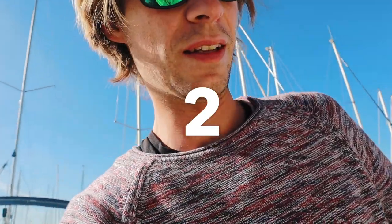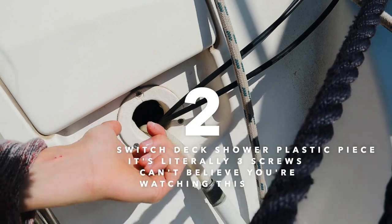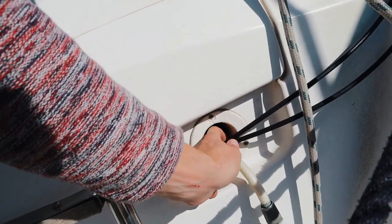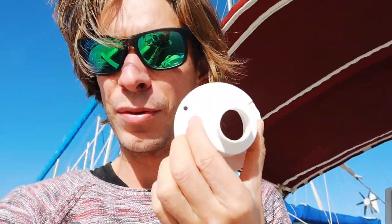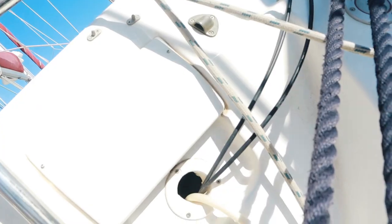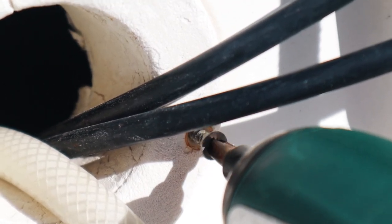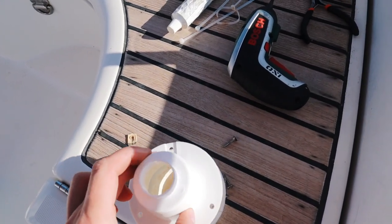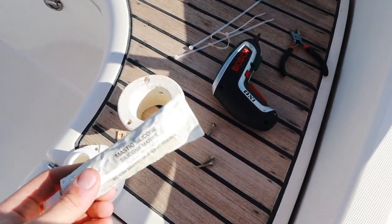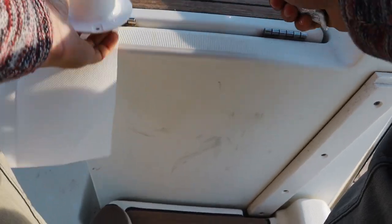We are going to replace a piece that has been bothering me since we got the boat. This is the outlet of the cockpit shower, which hasn't been replaced in probably all 18 years. We broke it off on the inside and there's plastic dangling around everywhere. We actually use it as an inlet for the solar which is on the Bimini — pretty dodgy, but it worked. We're gonna replace it with this brand new one and hope the two cables still fit. What we always do when we open up something and close it again on the outside: we put silicone on the screws so when you drill them back in they're watertight.